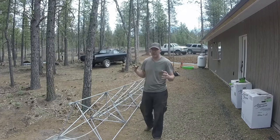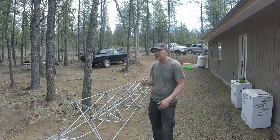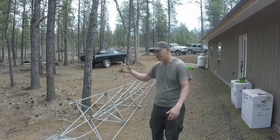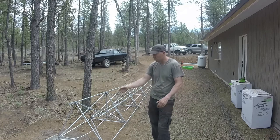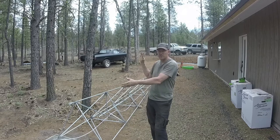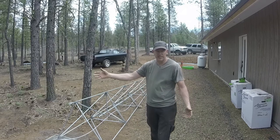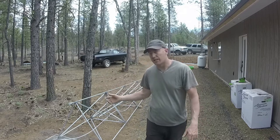I don't remember how much we paid for our cell booster. We have a Wee Boost. I think it's a middle of the line cell booster. Seems to work all right, and we're just going to use it on top of this tower. The wonderful thing about this tower, the way it bolts on, so I can pivot it down. If something goes wrong with my cell booster on top, I can just take one bolt all the way out, 2 bolts loose, tilt it back down, swap out to a new cell booster, and tilt it back up into place. I don't have to worry about taking the whole thing down or falling down as I'm trying to take it down. That's why I made the base the way I did, so that it would tilt up and down.